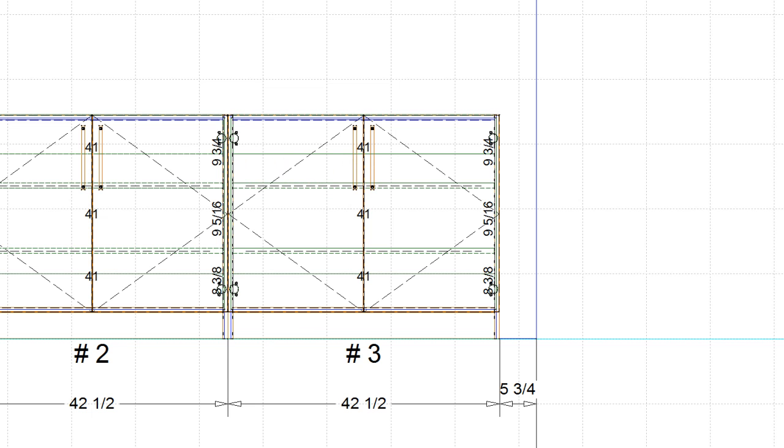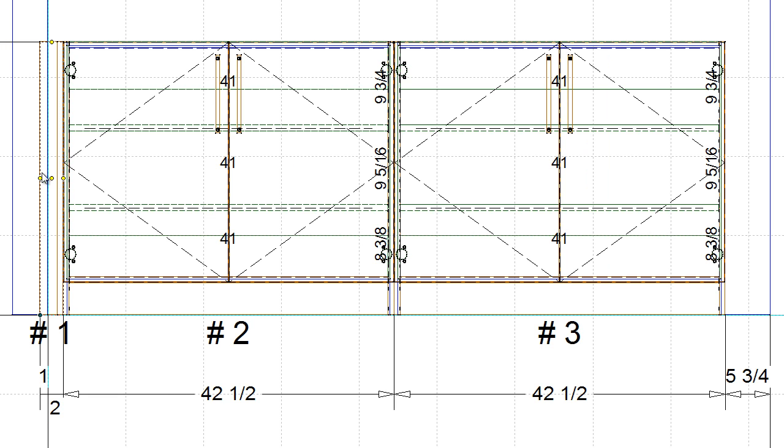And what you could do is, on site, after you put the backer in, you just attach the face piece to there, and you can actually scribe it to the wall so that it mirrors the contour of the wall. And that's going to create a real nice look. So you don't have to use scribe molding, which is basically just another little piece of molding that can flex to the wall. So that's just a little bit over width. That's just a little trick. You can order it 2 inches wide as well and just push it right up against the wall and have a hairline gap right there. That's fine too. Either way.